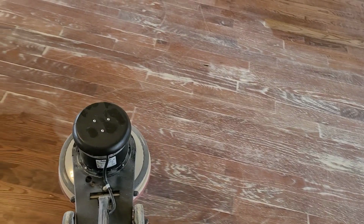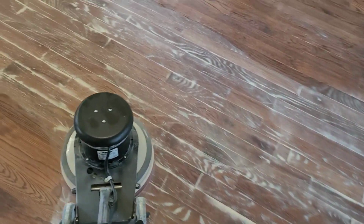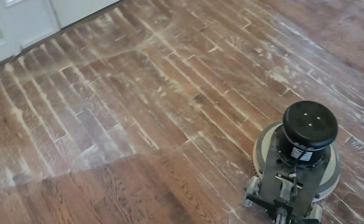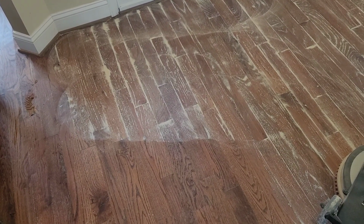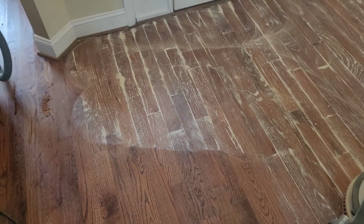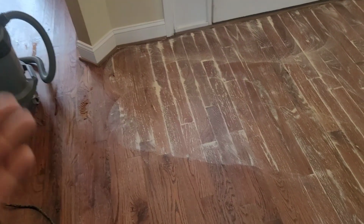And technically, especially depending on the house, they recommend that this is done every 3 to 5 years. Oh, really? Yeah, to maintain the floors. Because once that polyurethane starts breaking down, now you just get into the finish. That's when the floor starts becoming hydrated and absorbs so many particles. The main thing about the polyurethane is to protect the floors. But eventually, just like when we clean carpet and put Scotchgard, eventually it's going to wear off. The same thing with polyurethane.